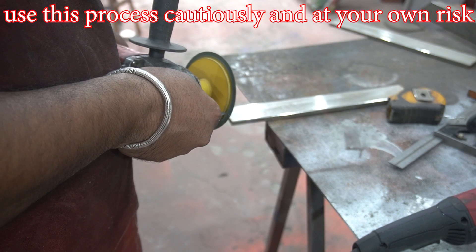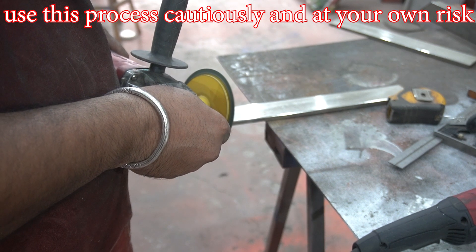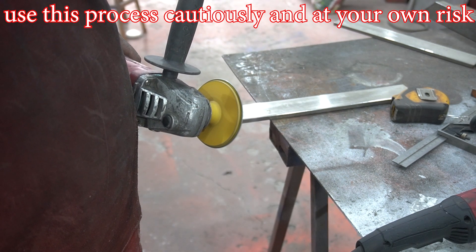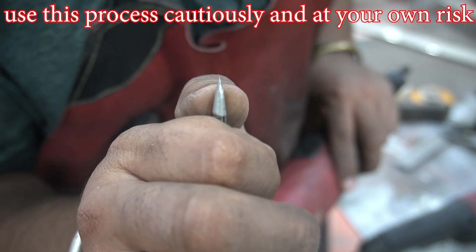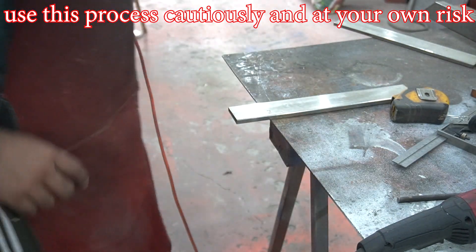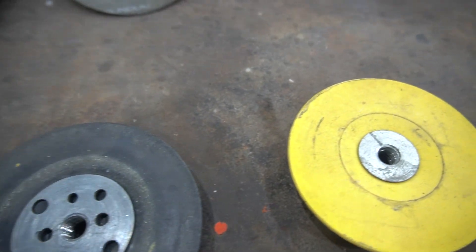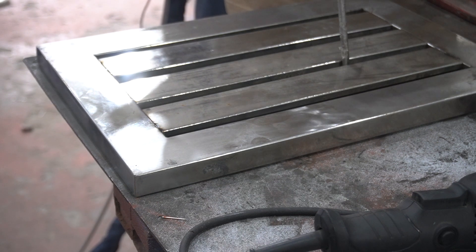These fiber discs have an issue where the periphery gets worn out first. Since they are expensive, I want to use them entirely. To do this I use a piece of carbide bit, making sure it is sharp enough, and use it to cut away the worn-out excess. This is dangerous work — hold the grinder in a bench vise, turn it on, and use the sharp carbide tool to trim the excess, staying away from the direction of wheel rotation. I have multiple backing pads trimmed down to smaller sizes for use in tight areas. After that I weld the middle pieces and legs, and then we can start the polishing process.